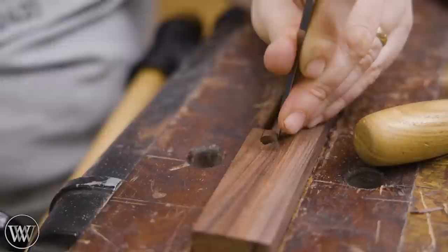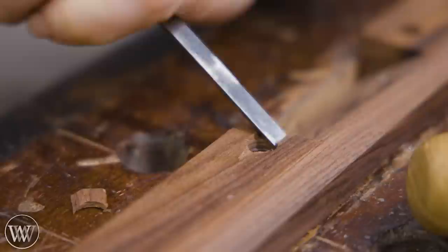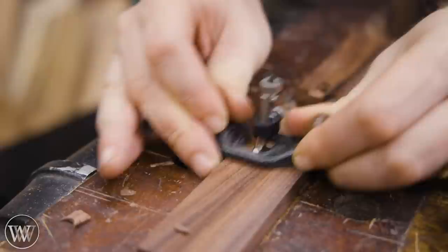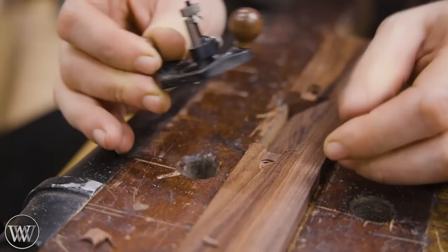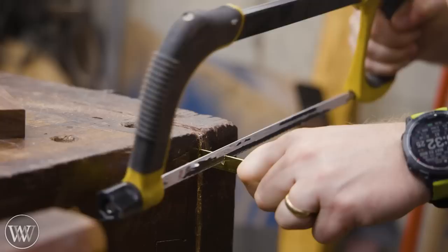Now we need to connect the dots between the two circles we created so that iron can fit in and slide down. We need to cut it down to the depth that the iron is thick. I'll come in with the chisel bevel down and get rid of most of this. I've got this little router from Veritas — it's a cute little thing — and I can use it to make sure the bottom is precisely the correct depth so that the iron doesn't go down any farther than it should.